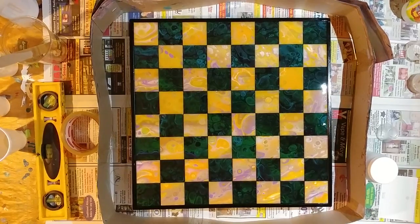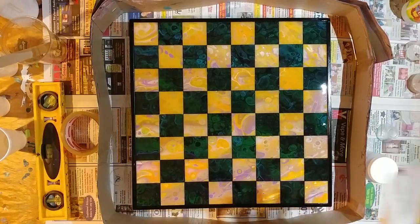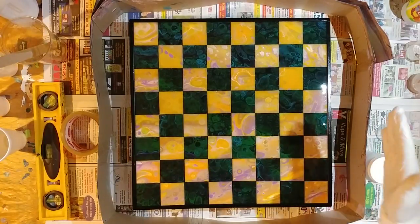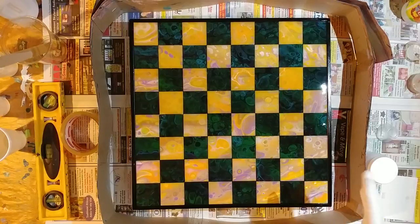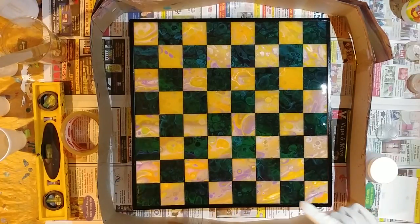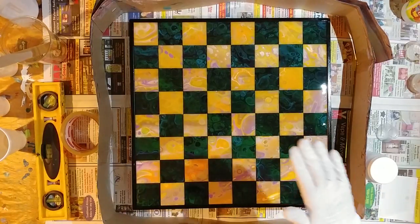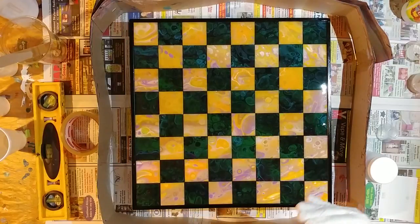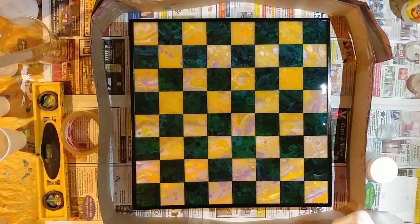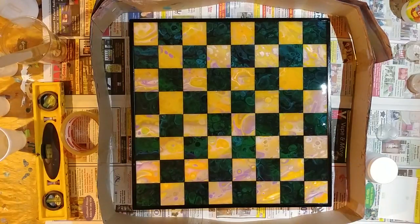All right, here we are. We're back. I have painted the trim. I countersunk the nails on the sides because they just weren't working. So I countersunk them and wood puttied over them. Actually, it's not wood putty because wood putty doesn't actually harden ever. It's called plastic wood, and it's really cool stuff. You can put it on there and sand it off within like 15 minutes. And then I spray painted the black lacquer over the edges. It actually looks nice and neat now.